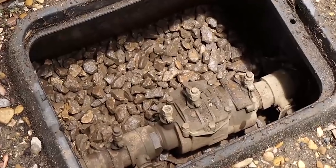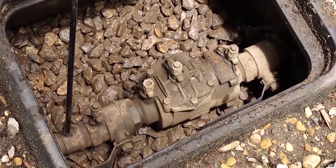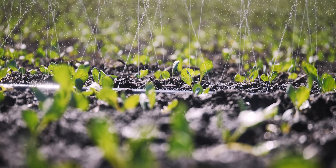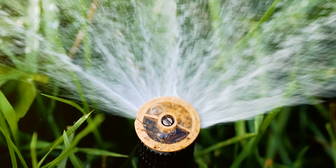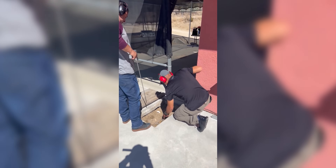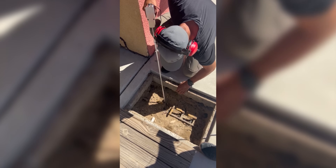Listen at the meter, listen at the double check, and listen at the valve box at the house. Why those three places? You want to listen at the meter to see if there's a leak nearby. Listen at the double check because if it's on the irrigation system, I tell my customers they need to call an irrigation company — they're going to be cheaper than me. Then check at the valve box at the house because that separates my system: I've got a yard system and a house system. Once I know where the leak is, it lets me know where to look.